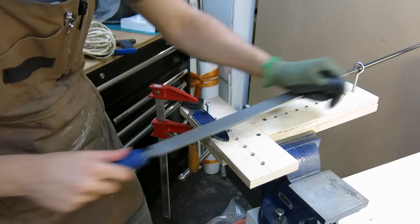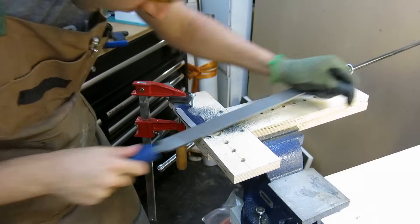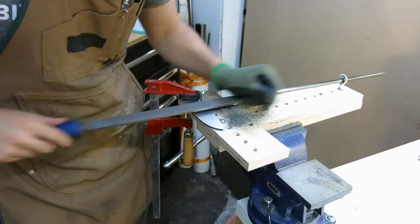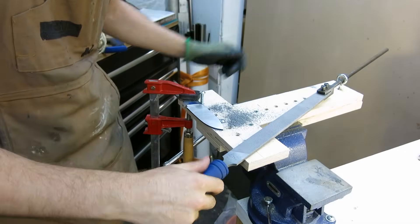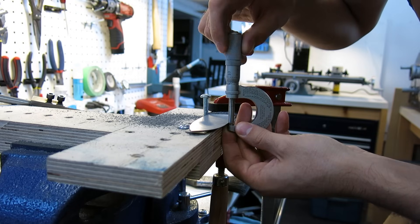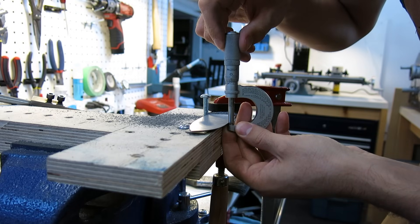The process of testing started just before I got my grinder. The first few blades were done using my filing jig and the remainder were made on my new belt grinder. The edge thickness on every blade needed to be as similar as possible in order to make the tests valid.